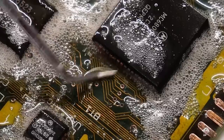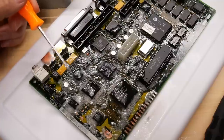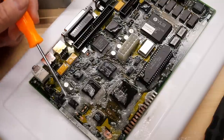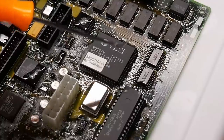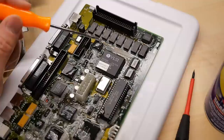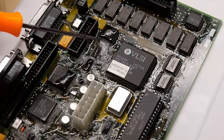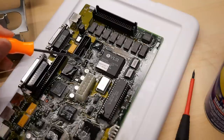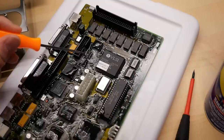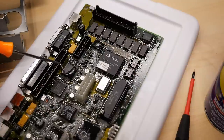Now that it's washed away, we're actually seeing the copper underneath. There's a lot of WD-40 floating on this board right now. What's really fascinating is anywhere there was corrosion — either from the battery or from the electrolytes that leaked out of the surface mount caps — the WD-40 is all bubbled up, and this WD-40 has been sitting on here for hours. But in other areas of the board where there was no corrosion whatsoever, the WD-40 is not bubbled up at all — it's just a wet coating. I'm not really sure if what's happening here is some kind of a chemical reaction between the WD-40 and that electrolyte, and if this is actually benefiting in any way. I'll be curious to let this sit for several more hours, wash away the WD-40, and look at how things look underneath.